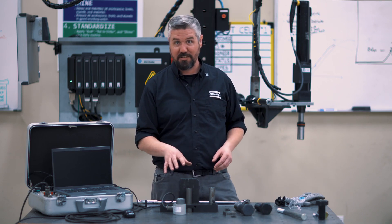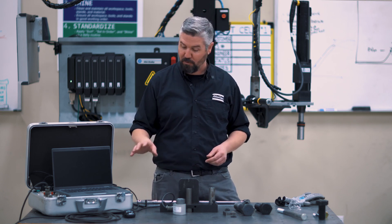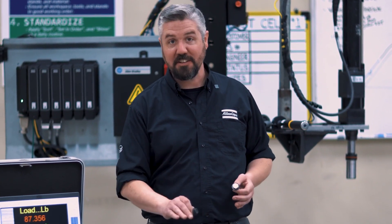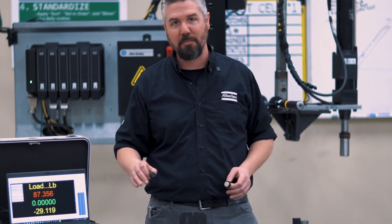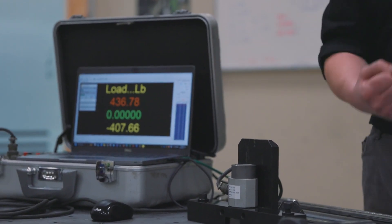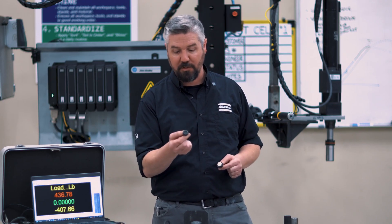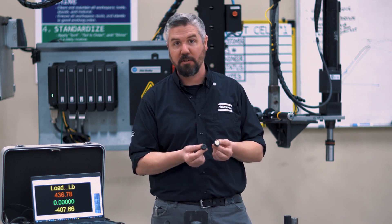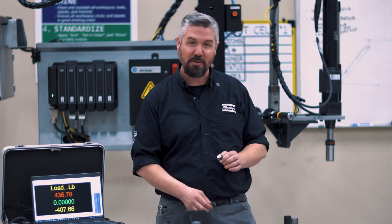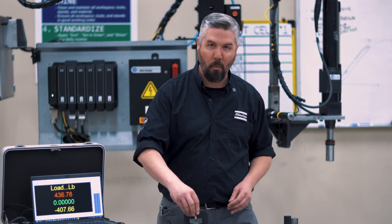Now let's get to breaking some of these things, because that's what we do in here. We're going to break an M12 bolt versus a half inch bolt — they should have similar strength properties — and we're going to read what the force is with this load cell. So we're going to do a failure test. We're going to measure the clamping force generated during the tightening and take these all the way to failure. I have a half inch bolt, grade eight, and an M12 bolt, grade 10.9. These are very similar in material strength. The cross-sectional area of the half inch bolt is slightly larger, so I expect slightly more clamping force. Let's break this bolt with an over-torquing event.